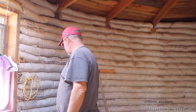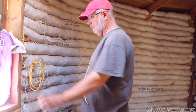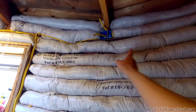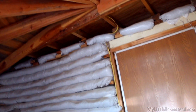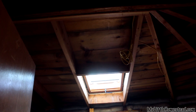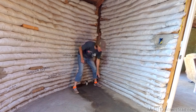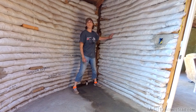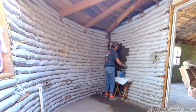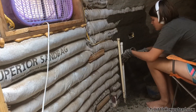The electrical plan is to move the box up to counter height. We'll put lights above the sink and at the front door where you walk in, on one switch that flicks them both on. One will sit on the same bay as the skylight. Gary's going to get those wired in so we can start working on the walls and begin stuccoing. We'll add a little cement to the mixture for a stronger wall, and we'll probably work in pairs since the room is small.